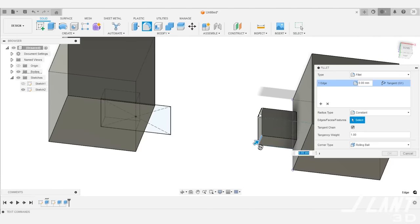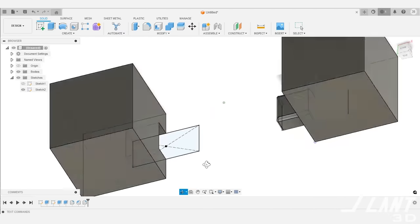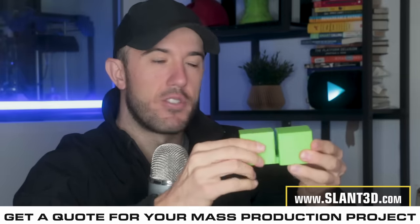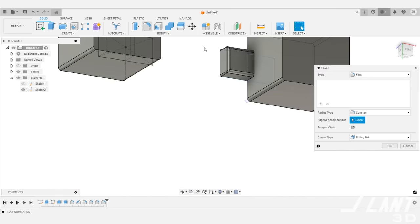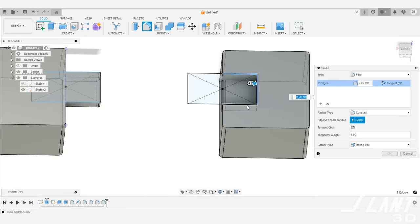This isn't a bad approach, but it doesn't hold together very well. If you are designing these, make sure you chamfer the insert just a little bit so it's able to wedge into the main slot — the 3D-printed layer lines can actually cause them to lock together fairly reliably. But you don't have any pulling force to eliminate the gap between the two pieces, and there are a lot of tolerance issues, so this isn't the greatest locking feature even though it's the one most people go to.